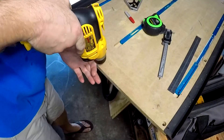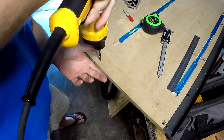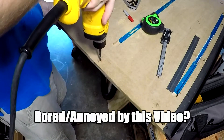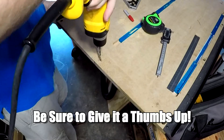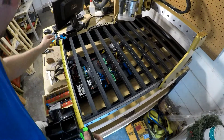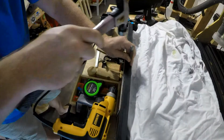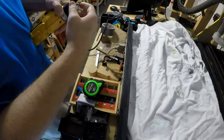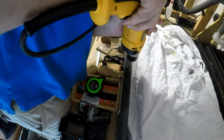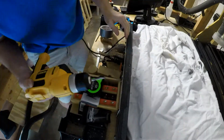So I went to work adding the two extra bolts. Once the MDF table was off, I marked a point in the middle of the hole in line with the sides, then drilled the MDF — that was the easy part, as the steel base would be fairly difficult to drill with hand tools. After thoroughly checking it out, I measured and marked where my tapped hole would go. Since there were electronics underneath, I covered the area with an old sheet to catch most of the debris. The drilling process started with making a small indentation with a hammer and punch, then I opened this up with a center drill, and finally started actually drilling, adding oil along the way. It was slow going, but I took my time and didn't have any issues.